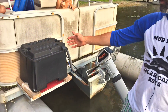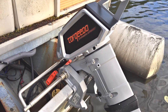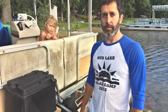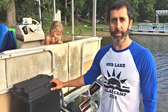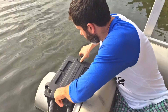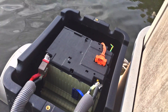The first main components of my solar electric boat are the electric outboard and the 48-volt lithium-ion battery. This is a Torqeedo Cruise 4.0 — it pulls 4,000 watts maximum, so that's about 83 amps continuous out of my 48-volt battery. The lithium-ion battery is in a commercial-grade weatherproof plastic box, right where the gas tank used to be. Each cell is 3.2 volts nominal.